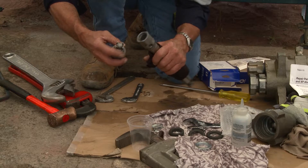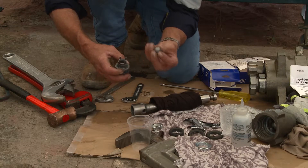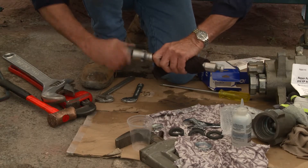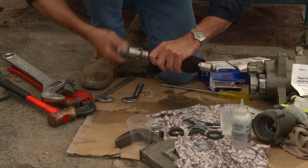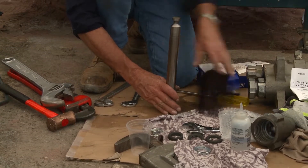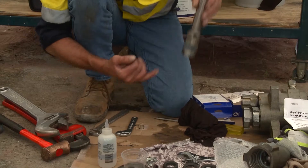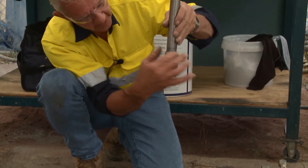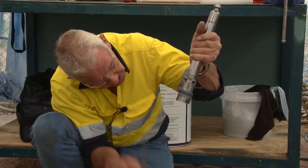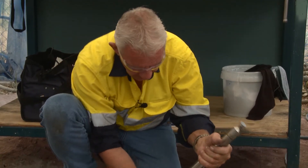I can check the seal on this ball as well. What I'm looking for is to make sure that the seat hasn't been compromised, so I'll still use the same ball I took out of there. I can screw that back in — you don't need to tighten it up with torque; the torque on these is 60 foot-pound when you're in a workshop environment. Stand that piston up, and I can use this oil. You see it floods out there — what I'm looking for is it coming out the bottom. It's coming out the edges here, out of these venturis, but it's not coming out of the center. Just to make sure you understand that: if I put the screwdriver up there and move the ball, there comes the oil. So the ball is pretty good — the seat hasn't been compromised.